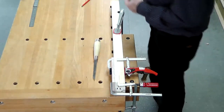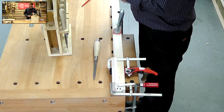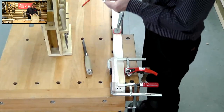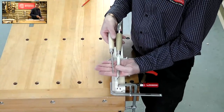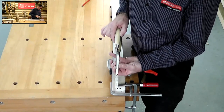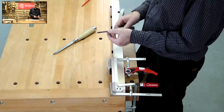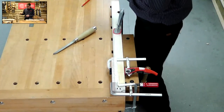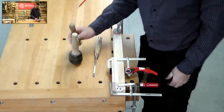We want our mortise chisel. Looking at which one seems sharper. We've got an 8mm mortise chisel for this — about a third of the timber width is a guide for your tenon. If we go with a normal chisel, can you see the width difference? This is a lot thicker — maybe two or three times the thickness. Why do we need a mortise chisel? It's got more structural strength. Your little beveled chisel might get away with it on smaller, shallower mortises, but something like a table leg you need that structural strength. We also need a beater.